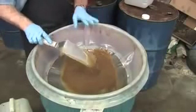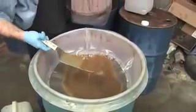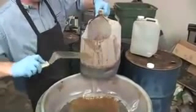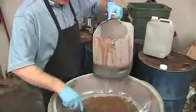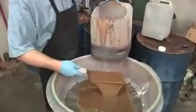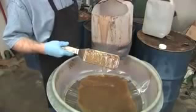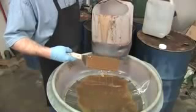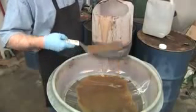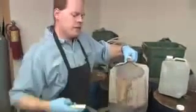So we're going to let this sit here for a while. One thing I do want to show you though, a lot of times you're going to get really thick oil and you need to get rid of the crusties. So we cut a carboy open, which is typically what you're going to get oil in, and we just scrape it into there. So again, I'm just moving back and forth real slow. And you can see some of these chunks that we're getting out of that. It's usually food particles, stuff from the grill, French fries, all that stuff that they put in the oil over at the restaurant that you really don't want in your fuel, particularly in your truck. Okay? So I'm just going to filter that out. And our next step is showing you how we load our machine full of oil, and we're going to make a batch. So we'll see you in a second.